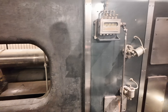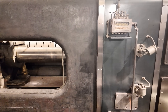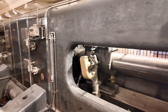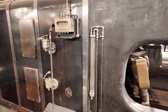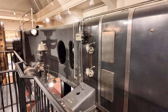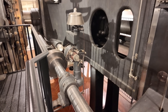So how does this work? Inside this section you have a double-acting cylinder with a four-cycle engine, and you have the same thing on the other cylinder. You still have the same single drive shaft, and you have two cylinders with a 42-inch bore — both of them are the same — with the same 72-inch stroke. And surprisingly, the same 2,750 horsepower that the steam side produced, and even the same shaft down here to synchronize everything.